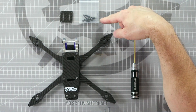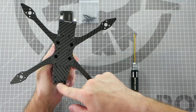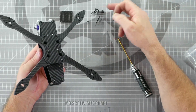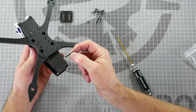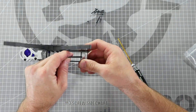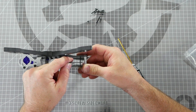The receiver plate and video transmitter screws are also provided to help you mount your electronics in the rear of this frame. In the back of the frame you have 20 by 20 and 25 by 25 mounting options, perfect for today's video transmitter systems. The bag of screws has four 20 millimeter M2 screws and eight M2 nylon nuts. Line them up to the 25 by 25 or 20 by 20 pattern depending on your needs, slide them through from the bottom and install the nylon nut on top. I don't generally use the receiver plate but it's provided in case it helps you space your receiver or video transmitter.